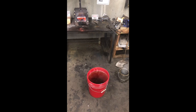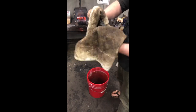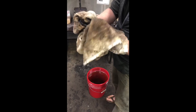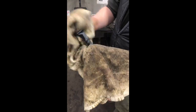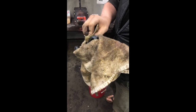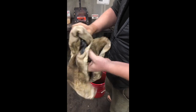The next thing - really the last step - is that once these come out of the beeswax they're still a little hot, and we want to get that excess beeswax off. I've got a terry cloth towel here and I'm giving them a good aggressive rub down. The important thing is I don't touch the metal directly - it's still hot enough to burn me - so I keep the towel between me and it. You can see that darkened it up and gave it a nice patina.